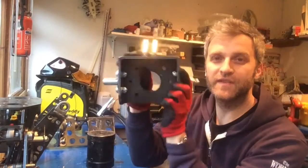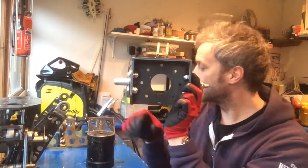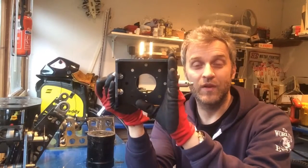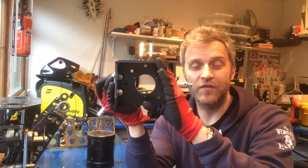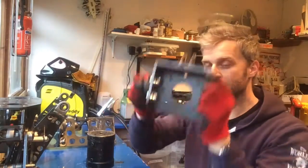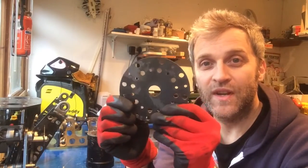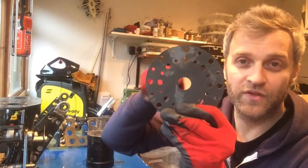One last thing before I go - I made a mistake on the tilt mechanism piece. Around the ring of holes where the rotary actuator attaches, I didn't check the drawing properly and assumed they were lined up straight from the clock position for plus or minus 90 degrees. In fact they're clocked by 22.5 degrees, so my actuator wouldn't have been centered. To rectify this without remaking everything, I made a jig from the last laser cutting run - it has the original holes and a new set of pilot holes so I can bolt it on and use it as a guide to drill the new holes.